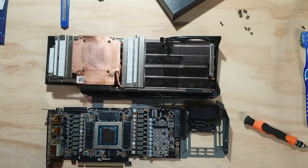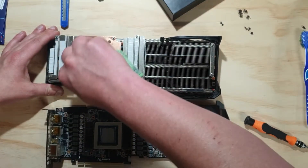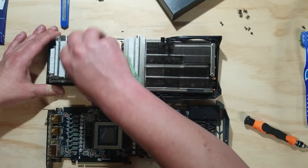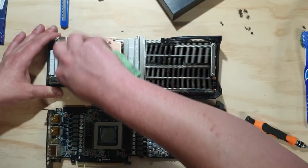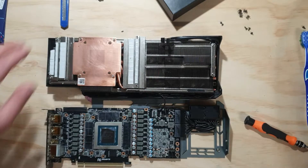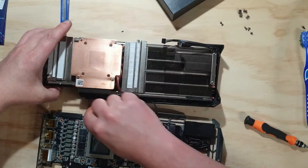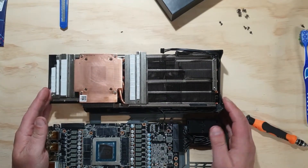I'll just polish this up a little bit as well, make sure we have nothing left over. There we go — it's looking much better now. You can also see on there — there are little markings where the thermal pads go, which is pretty good and might help me measure the amount as well. I'm pretty sure they're one and a half by five centimeters, just like on the 3080. But this cord is just getting in the way — we'll have to keep working around it because I don't want to break anything.